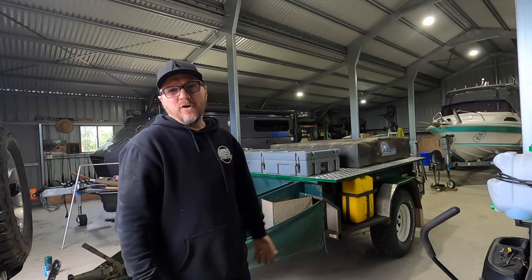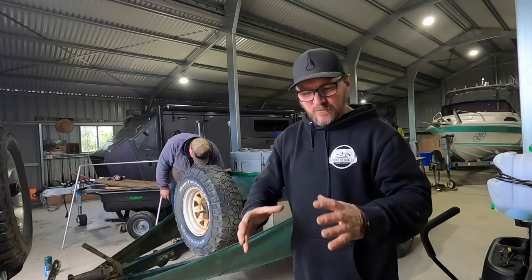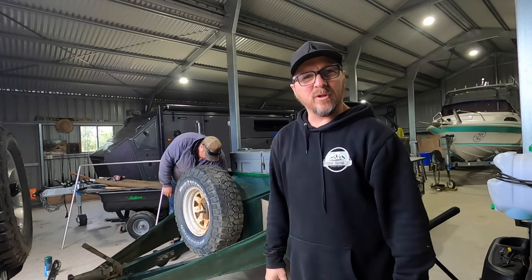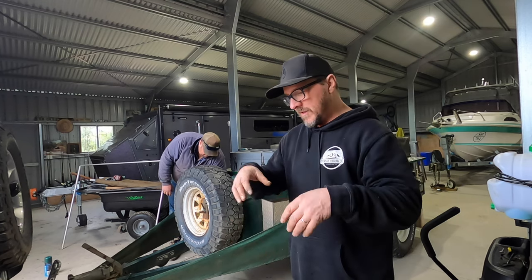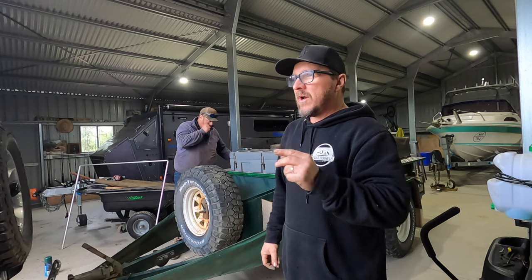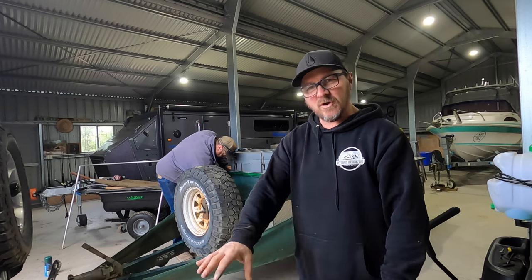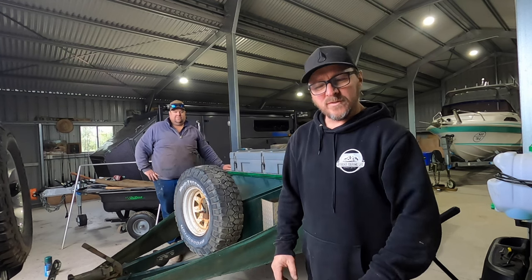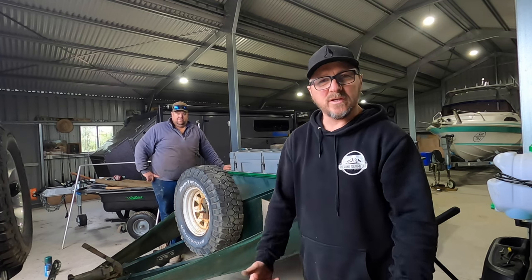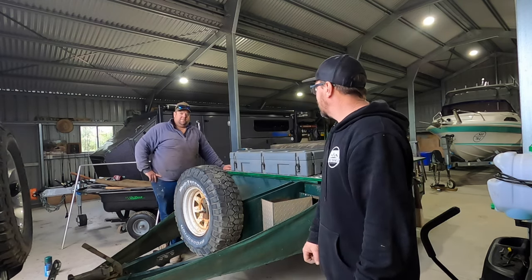Righto, so we're just doing the final piece of the puzzle. It looks like Ben's done all the work because I've been filming - big shout out to Ben for that. Where the wood box is, we've just cut and painted a plate so when I have some kindling or whatever else it doesn't fall through. Ben had a great idea - he's left an open lip around the outside so stuff doesn't catch water, it'll all drain out nice and easily and not rust out. We've metal primed all inside there as well and given it a coat of black. I reckon we're about done.